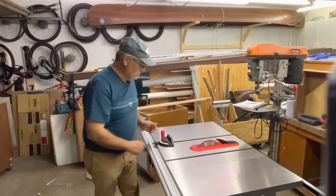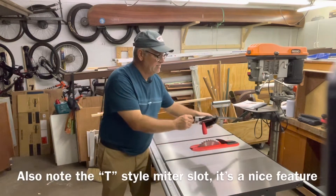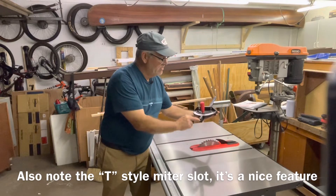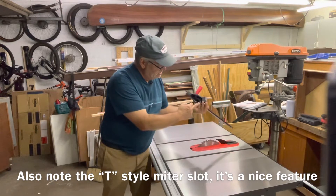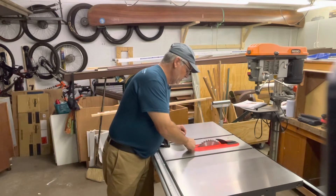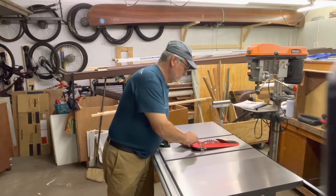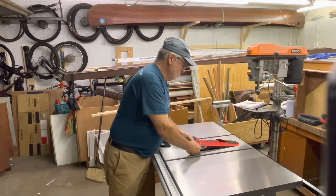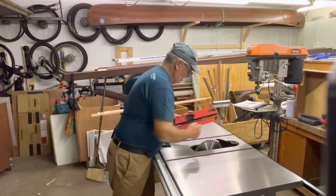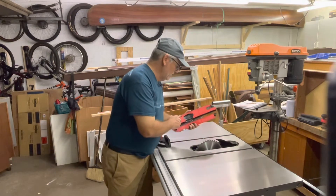It's a very good safety feature. The SawStop comes with a pretty nice miter gauge. It's got a pin that goes to your stops, and your stops are adjustable — we have one at 0 and 45 degrees. Very nice setup. I've always had Delta table saws, so this is something new to me. To remove your throat plate, you bring up this lock and knock it out. These guys hook in the back, and then you have an actual locking mechanism that locks it back down into place.